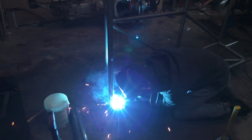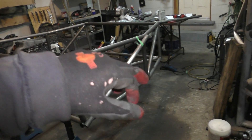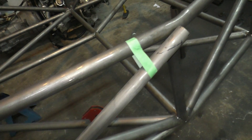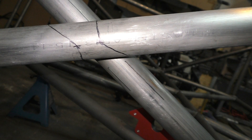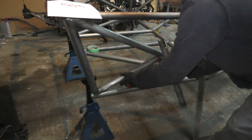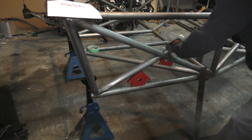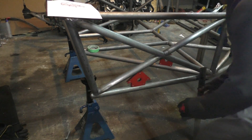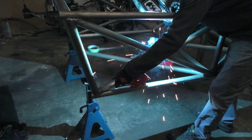Welding got a little difficult so I had to flip the chassis several times to cover all sides of the tube. The trickiest cross member tube had to be cut into two segments to fit around an intersecting tube, but still needed to align as if it were perfectly straight. I also had to notch the center of this tube where the other tube passes through. The only way to get the alignment exact is to notch the tubes slightly long initially, then trim down with an angle grinder to the final shape — very time-consuming but it gets the tubes perfectly straight.